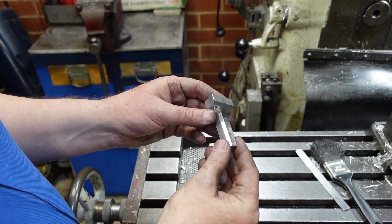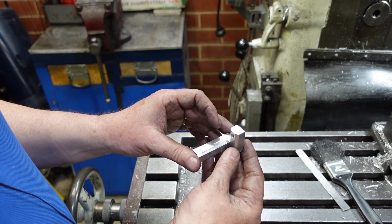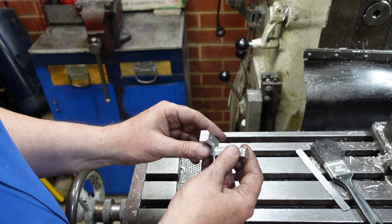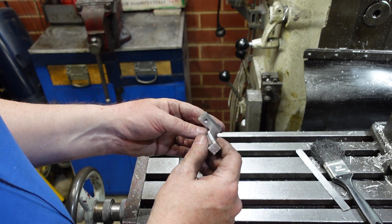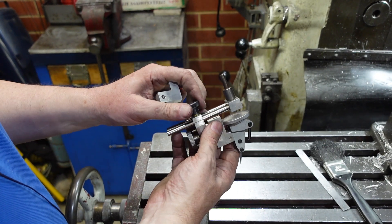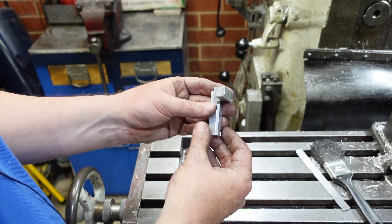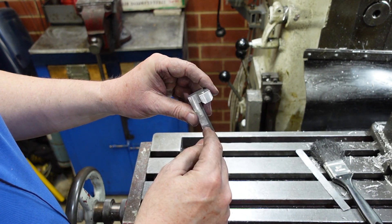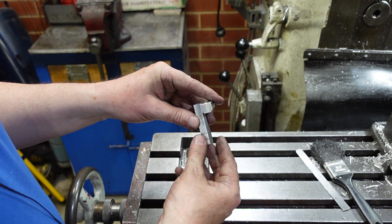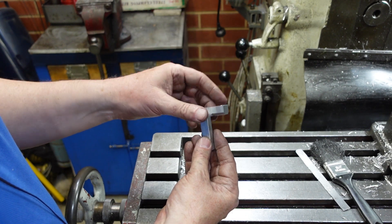There's the weird little base piece. You could have fabricated that, but for something this size machining is probably just as easy. I put a chamfer on there, there, and there, and then cleaned them up with a safe-edge file — one where the edge has been taken off so it doesn't cut on the side, it just cuts down. This chamfer is for better visibility of the dial — I intend to use this dial on it again and the vertical orientation gives a little better visibility. This chamfer here is purely for clearance for rods coming out of here with a bracket that kicks back. I've also tapped an M6 hole there for a spindle.